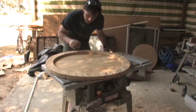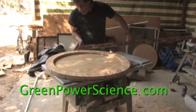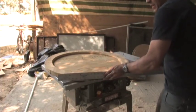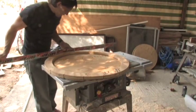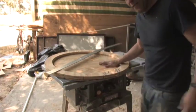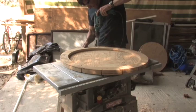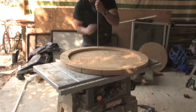There are a couple of ways to figure out where to put the rods. You can find the radius of the circle, use a tape measure around the outside, or use a flat ruler. Since I don't want to get too mathematical out here, I'll measure the circumference — about 60 inches, and then 35 inches further around, so 95 inches total. Divide 95 by 3 — roughly 96 by 3 — so every 32 inches. These rods should go in there just like that and they fit nice and snug.